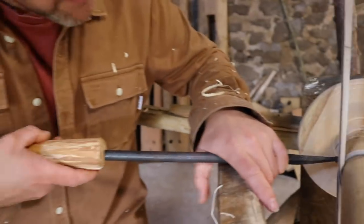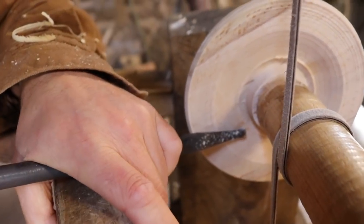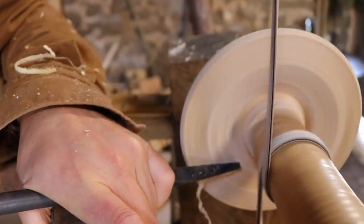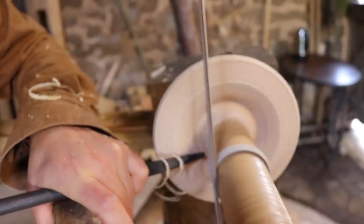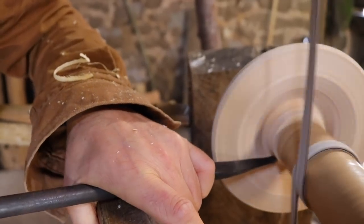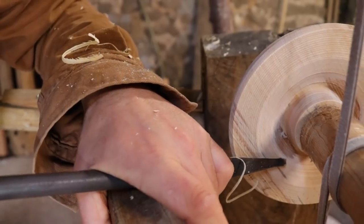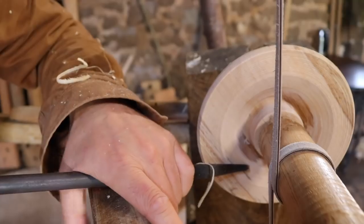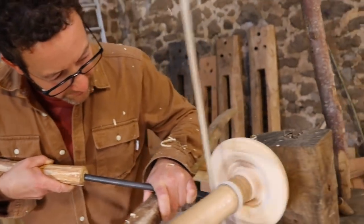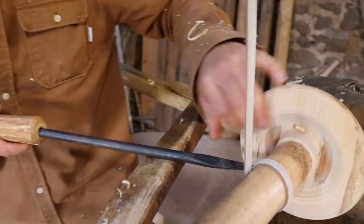So to open up this hollow even further, I can do what I just did, create a bit of a groove by scraping there, and then with the tip down tool, rest it on its nose essentially, and cut in there. I just caught the core there. So I've twisted again to horizontal, so I'm cutting the core now. Shaping the core, stopping it from flaring out, and then twisting around so the nose of this tool is just rubbing on the surface here, this slope, and then lean in till it starts to cut. So again, it's another way of excavating around this hollow.